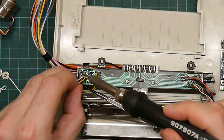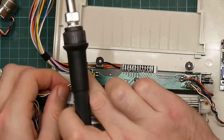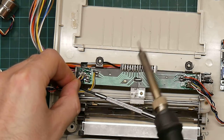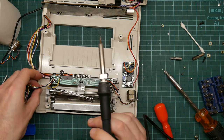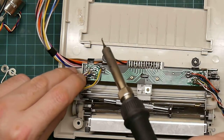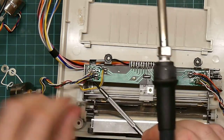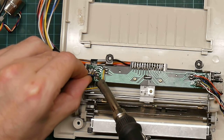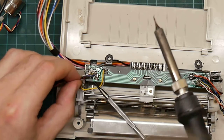Or, you know, just not fiddle with it. But I'm not a fan of those linear regulators. They do get hot. I didn't point it out, but the other plotter, there's a big chunk of metal here that was the heatsink. Let's try and get these back in place. One black wire. Ouch, ouch. That's not a good joint.